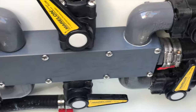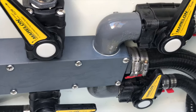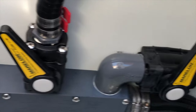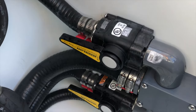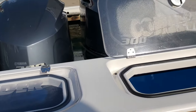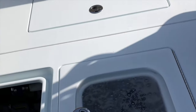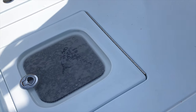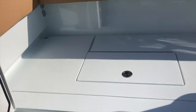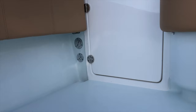The system's plumbed to a manifold — this is a six port manifold. They've got six live wells hooked up to it, so when they're transporting bait, they have the option to choke down the flow or add more flow to each live well, depending on how much bait they have. They have a single transom and a second transom live well, an in-deck live well, and the flush mount for the on-deck live wells. There's also one up front.